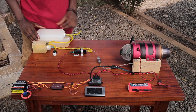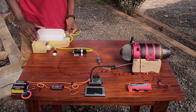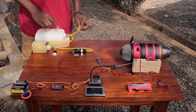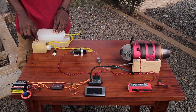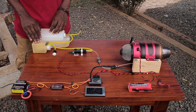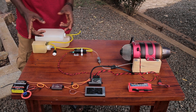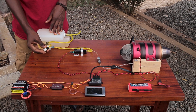Here is my fuel tank and this is filled with jet A1. I have two lines coming out of the tank — this is my vent line and my fuel feed line that connects to the UAT, the Ultimate Air Trap. This is a smaller tank that serves as an air trap that eliminates the possibility of an air bubble getting into the engine, which mostly causes flame out. Right here is my fuel line where I do all my fueling from.